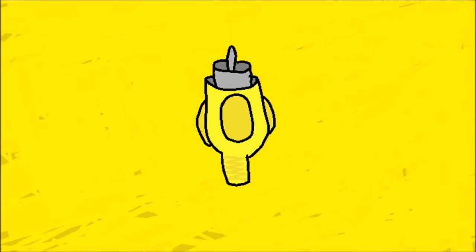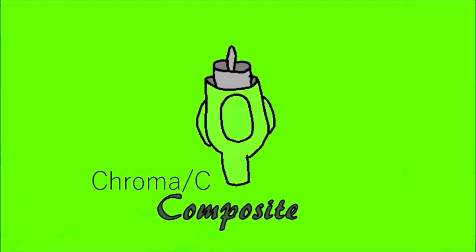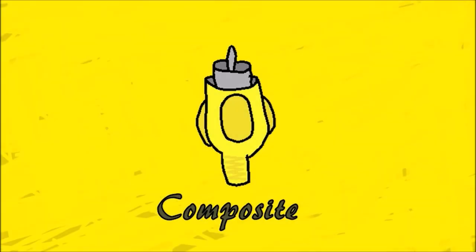That's right, all the video information is being pumped through the single yellow RCA wire. The colors, or chroma, the brightness, or luma, which is oddly abbreviated to Y, the sync, everything with a small, easy-to-use, readily available connector which dominated the back ends of the most nostalgic and well-known video game consoles of all time.